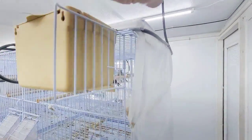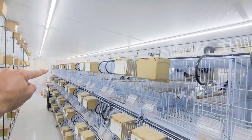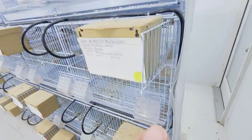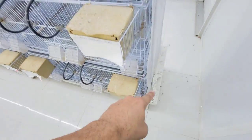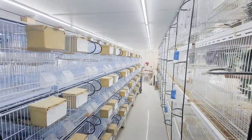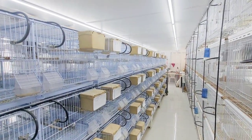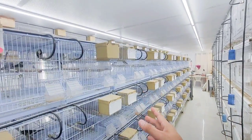When you do the S-motion like you see up here, this one just goes all the way to the end, curves down, comes this way, curves back down again, and continues like that. Once it gets all the way to the end, it comes out here and we have another drain system right here. So keep that in mind: anytime you put any of these valves, you do need to end with a drain so you're able to clear your system out every once in a while, whether you go vertical or horizontal.